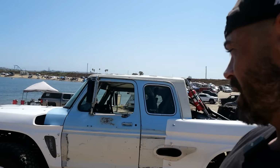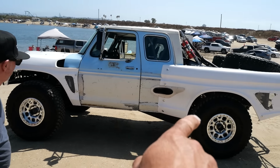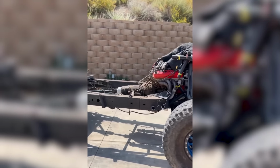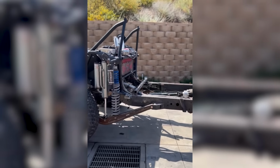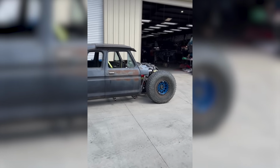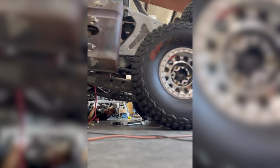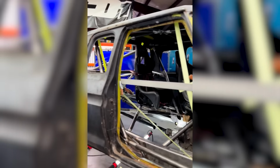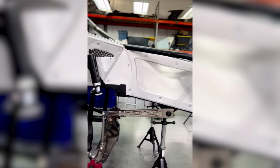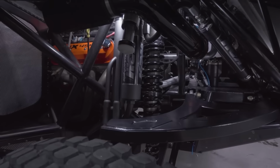And then really what ended up happening is this thing was 135 inches long, wheelbase length. We cut all the chassis from the front and the engine cage, removed the middle section, left a little bit of the rear fuel tank basket, and then we had the opportunity, why not put nice pivots in there, shorten it up, make it trophy truck length, and then we just built the whole entire chassis out. So it's essentially a new truck. Yeah. Big fuel tank, 75-gallon tank, big motor, big truck.